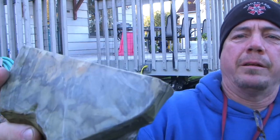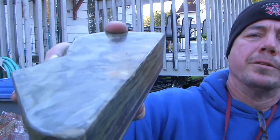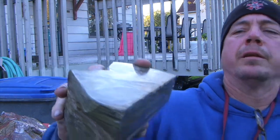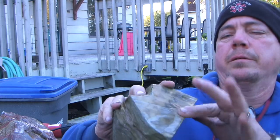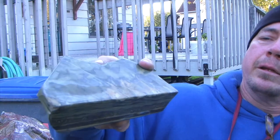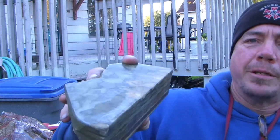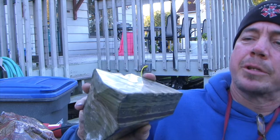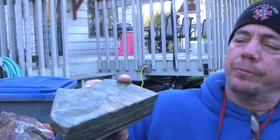And if you can see in there, there's some horrendous saw marks. So I'm going to start over at 50 grit. Maybe 100 grit. This one right here I can feel with my hand. And get rid of those and do that over. There's no sense in sending out an unfinished project to somebody. So I'm just going to do the same thing I did before in my dwindling light on this cold fall day.